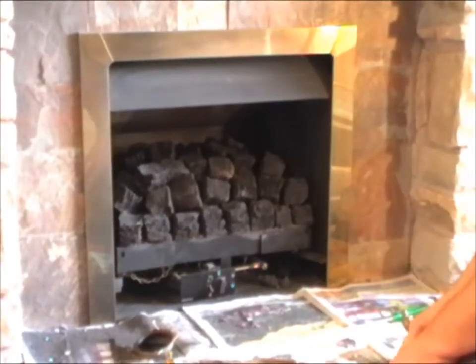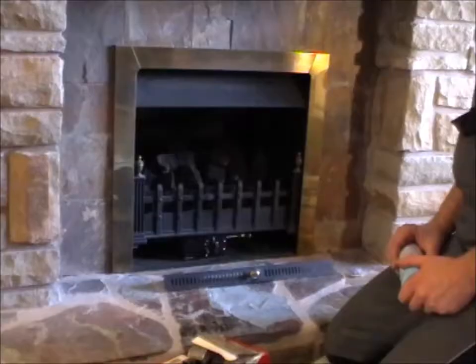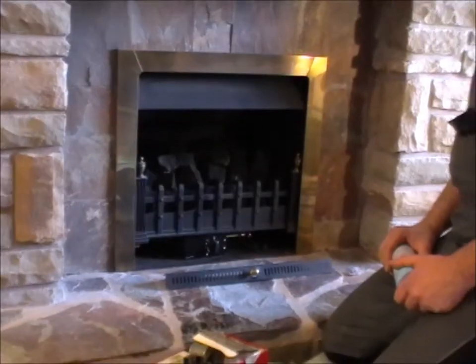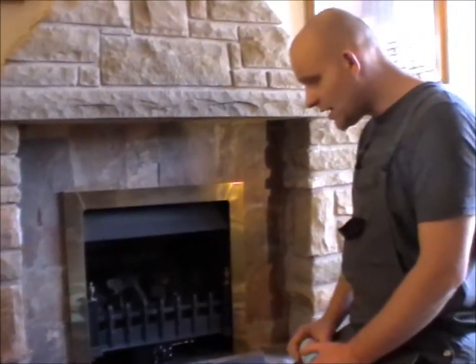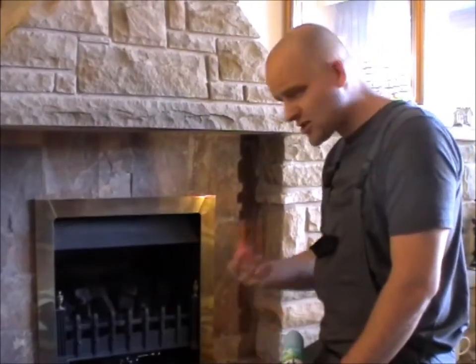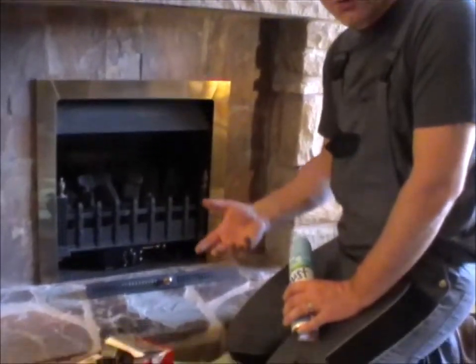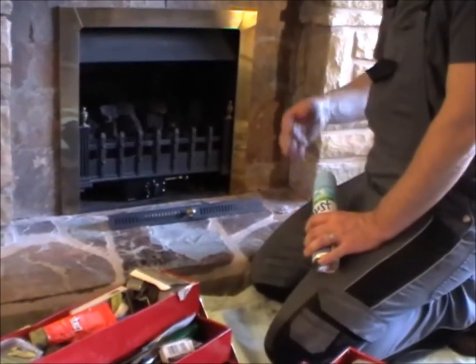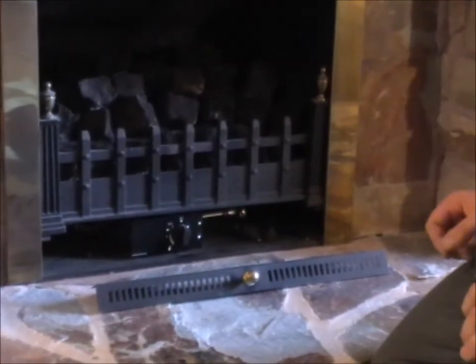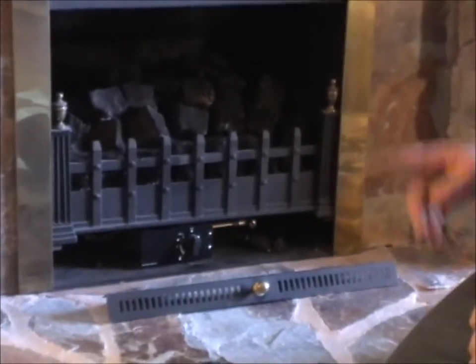So I've done the test, now I'm going to fire it once more and explain to the customer what I've done - any findings, any deficiencies, any weak spots or areas for improvement. I've been extremely happy with this appliance and the result. It's all done now, time for the handover back to the customer. I've vacuumed it all down and put some air freshener to get rid of the smell of the burning debris and the soot. It's always good to make an issue about the preventive maintenance work you've done - had I not brushed the coals off the thermocouple, maybe it would have broken down in the middle of winter or at inappropriate times.